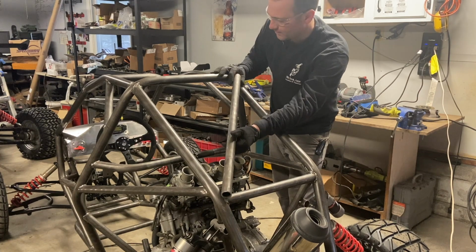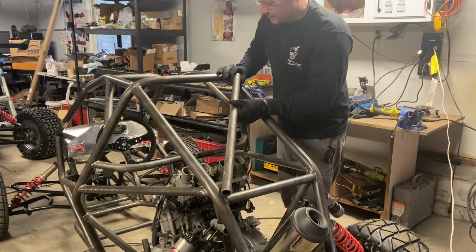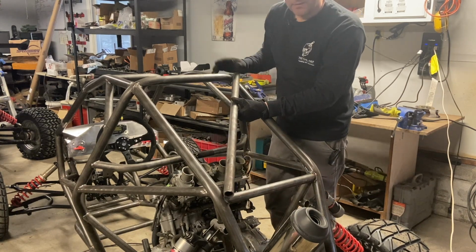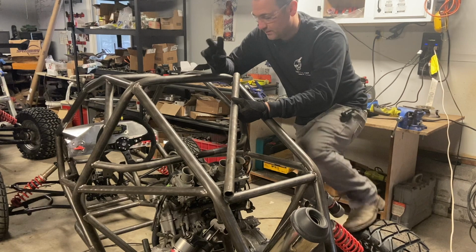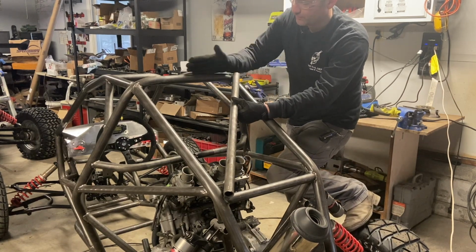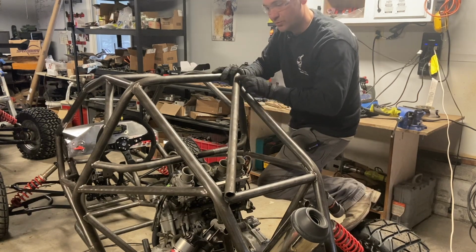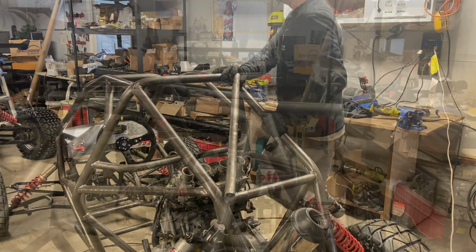So we've got our 29.5 inch piece. Now we've got to start figuring out how to notch it. This is going to be a double notch, which means we're going to notch one for this side and we're going to notch one for this tube. So we're going to run it through the notcher twice. So let's start with drawing our center line.